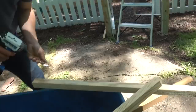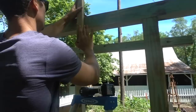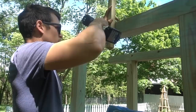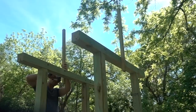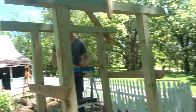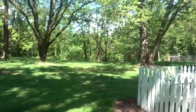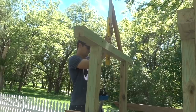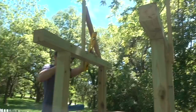When you get up there with it, mark the middle. It's four inches from the bottom — that's where the mark is. Then just put a level on it and put in one more screw. The point of the two-by-two is four inches above the peak of the roof and four inches below at the bottom — that's what's going on here.